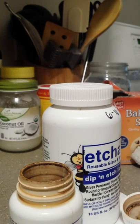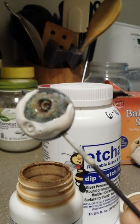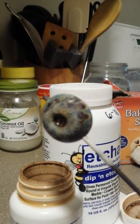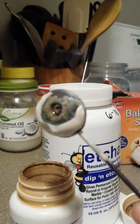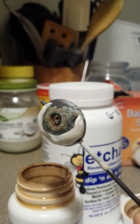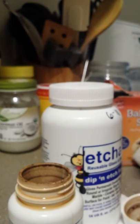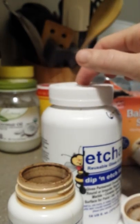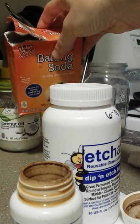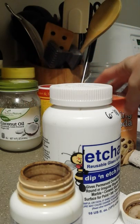I want to show you this one — this is the one that's going to be the most remarkable, so we'll see how dirty it looks. It's pretty dirty looking, so this will be the most magical one. What I'm doing is I've taken this giant thing of dip and etch. Wear gloves. Here's baking soda to neutralize the acid if you spill it anywhere, and if you get it on your skin it does burn, so you definitely want to be careful.